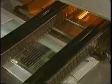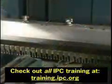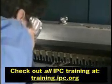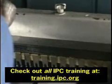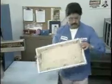The conveyor should also be checked for reproducible speed. Conveyor fingers should be inspected regularly for good mechanical condition. Make sure they are free of solder, dross, or flux buildup. Pallets should also be inspected to determine any twist or bow, and they should be cleaned.